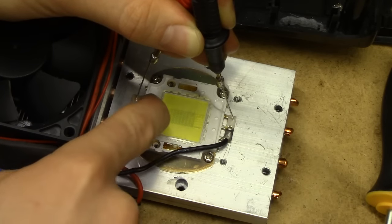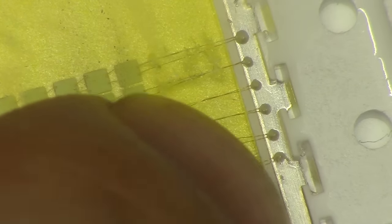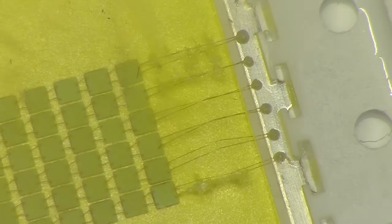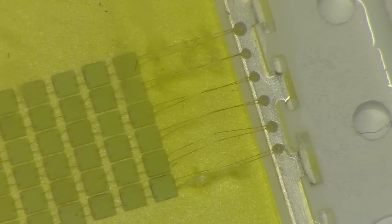That's weird — I've certainly never seen a power LED fail like this before. If you zoom right in there, you can actually see how the little ball around where the bonding wires just let go. I wonder what's caused that. But the metalwork around the LED seems to indicate that it's run very hot, so perhaps it's just overheated with time. It almost seems as if there's been a little spark which has just pushed the potting compound out of the way. A very odd failure mode anyway — I wonder if I can just jab a soldering iron in there and fix this LED.